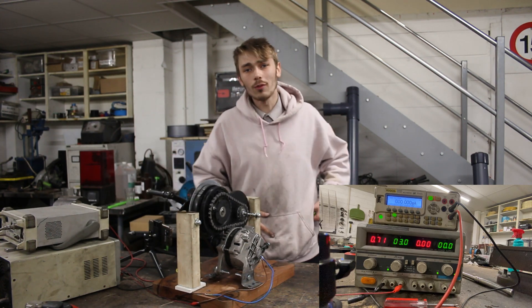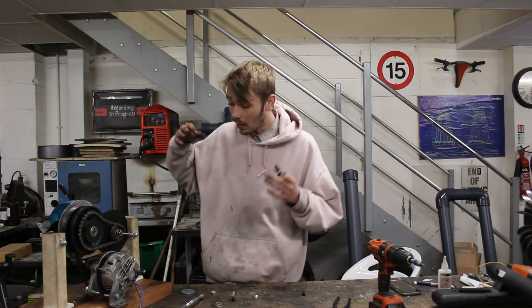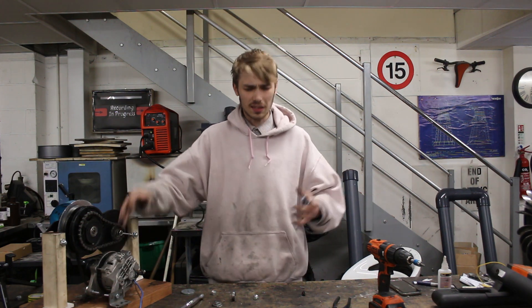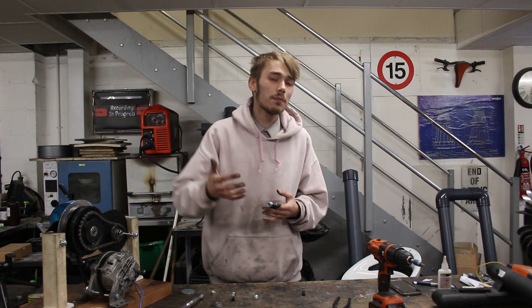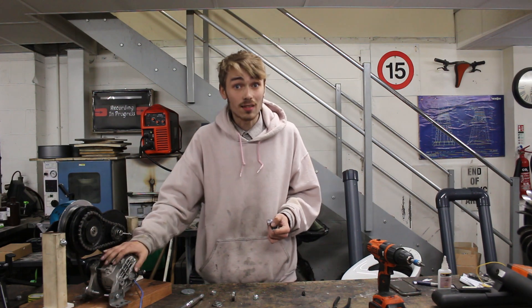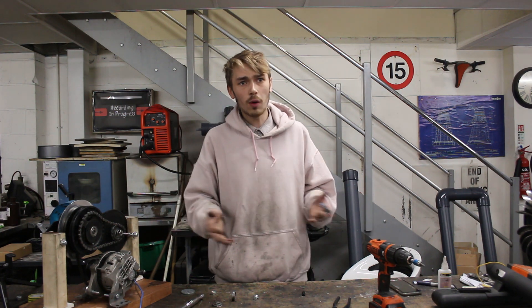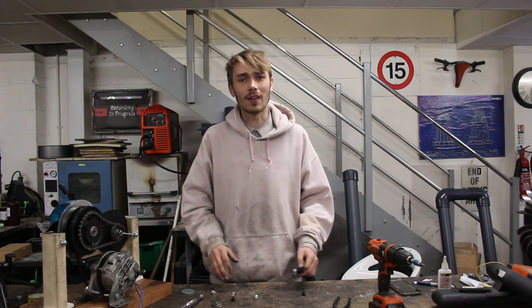So what's that in terms of watts? That wasn't bad at all. We could have pumped a little bit more amperage and voltage into this alternator to get a much bigger net generation, but I didn't want to exceed the torque requirements, and for me to turn it, it was actually really easy. So there's around 1.5 watts going into this alternator and we've got around 3.35 watts out of it, which gives us around 1.8 watts of net generation on top of that. I think that's actually pretty good.